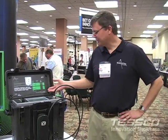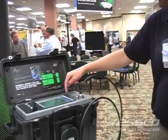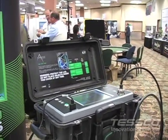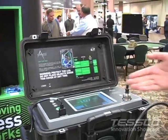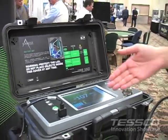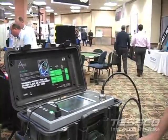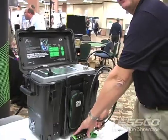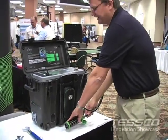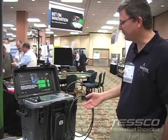By simply turning this on — I'm going to turn on the two transmitters and let it make some noise. What you're looking at is the magnitude of the mixed signals being created. In this particular case it's below NEG 97 dBm, we call that a pass. But if I have a loose connection and just by jiggling it, you can see the sensitivity of the equipment in finding those kinds of problems.